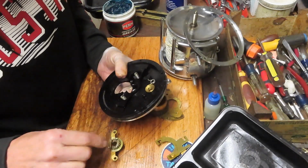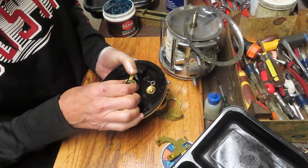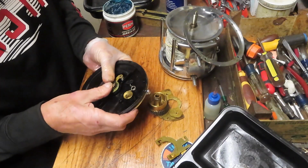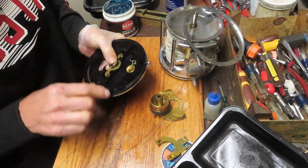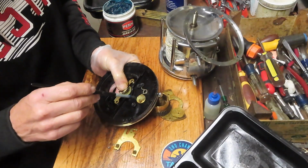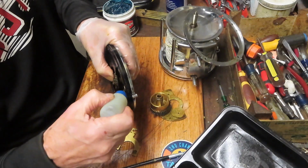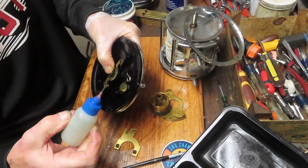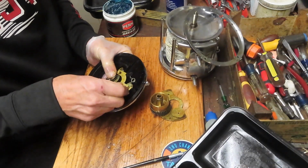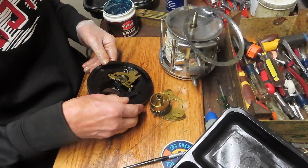To set the yoke, you have the two holes in the yoke, you have the two springs, you center the holes on those springs. Then press down, and again remember that the slot is facing you as you do that. A little bit of grease onto the eccentric, a little bit of oil behind the eccentric. There's a slot you'll find where that spring is, you can oil it there. Take your jack and set that up, and then you can relieve the pressure for a moment there. So that's how you set that side.